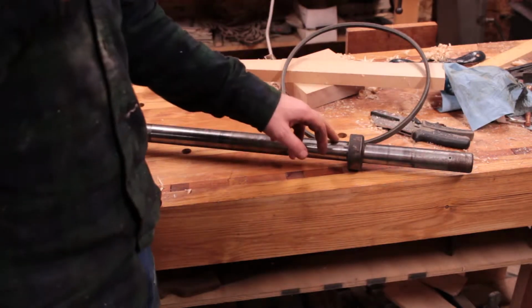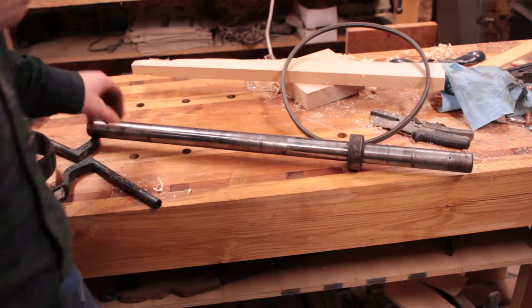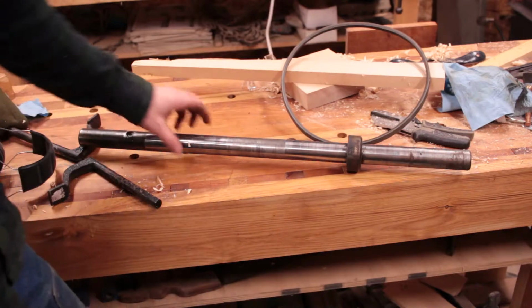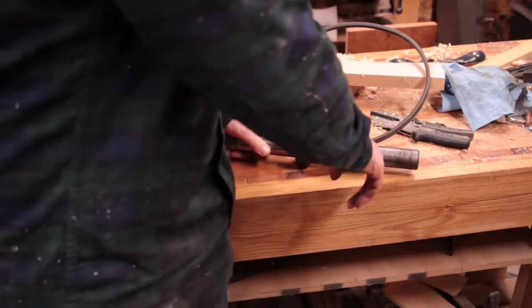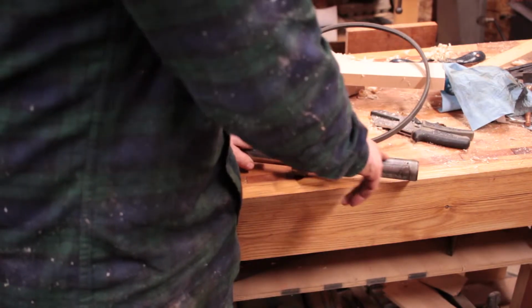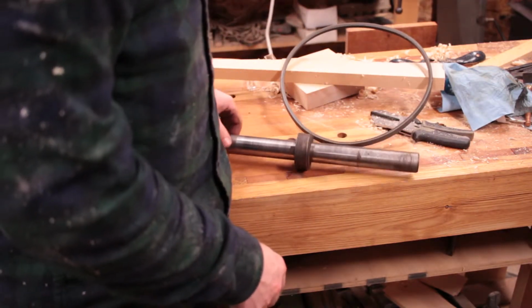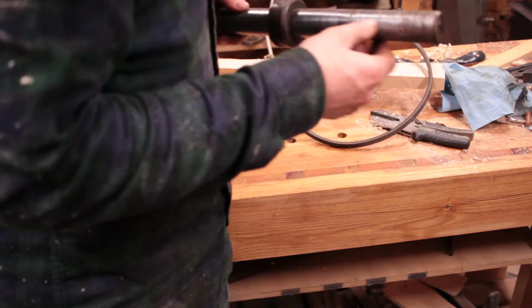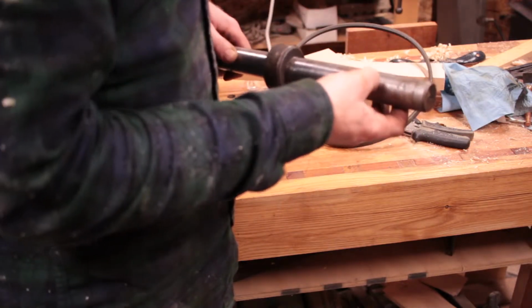So I got the shaft out of the bandsaw. This is what the lower wheel runs on. There's a big set screw here which pins it down onto the shaft. And before, it had just these 4 set screws clamping on that big flywheel. So that flywheel is not the best solution. Kind of marred up the thing.